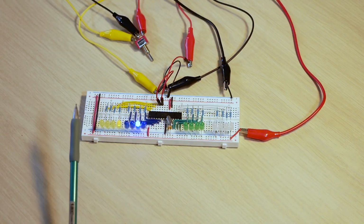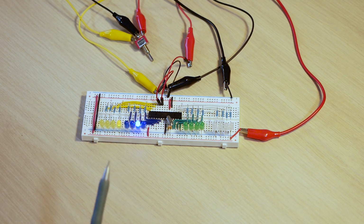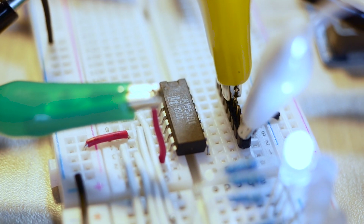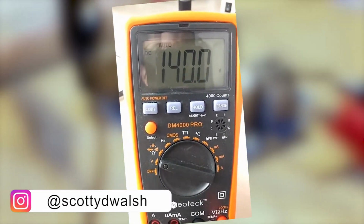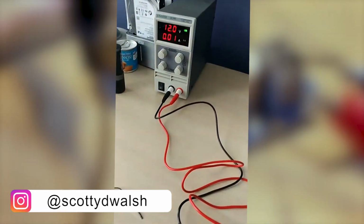Like I said before, I won't be using these LEDs in the final project, but each 4-bit digit will be sent to a Nixie tube. But since the Nixie tube doesn't display binary, the 4-bit binary needs to be decoded into something the Nixie tube can understand, which is where this old Soviet integrated circuit is useful. All these really contain is a series of logic gates that will output a DC signal to each cathode digit within the tube. The anode of a Nixie tube requires quite a high 170 volt DC potential for it to turn on, or fire as they say.